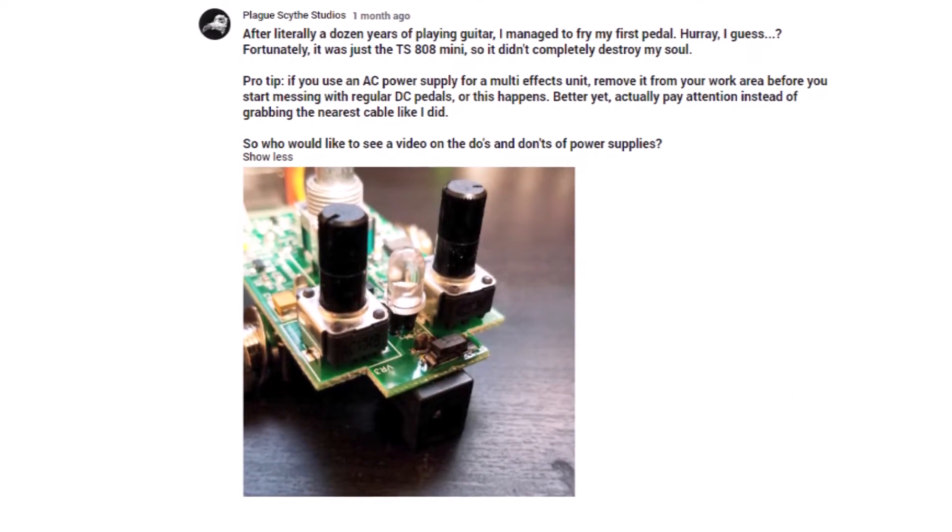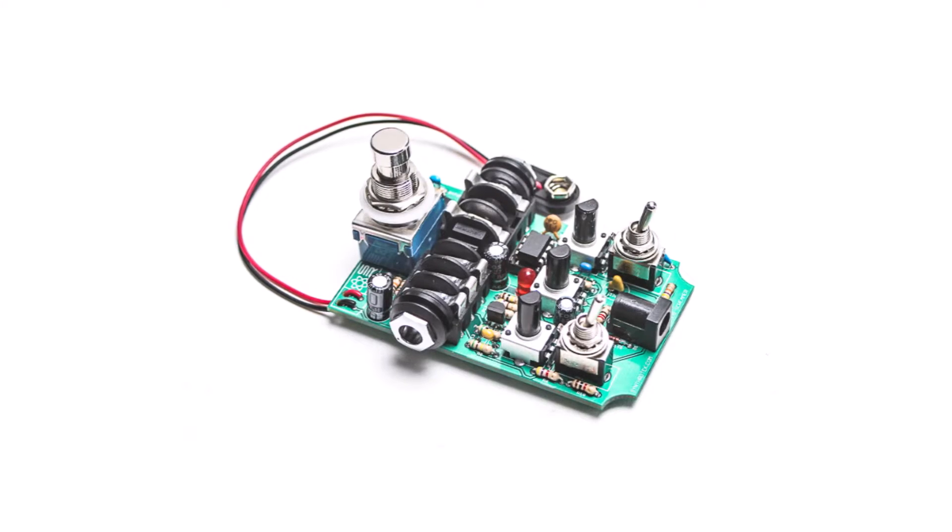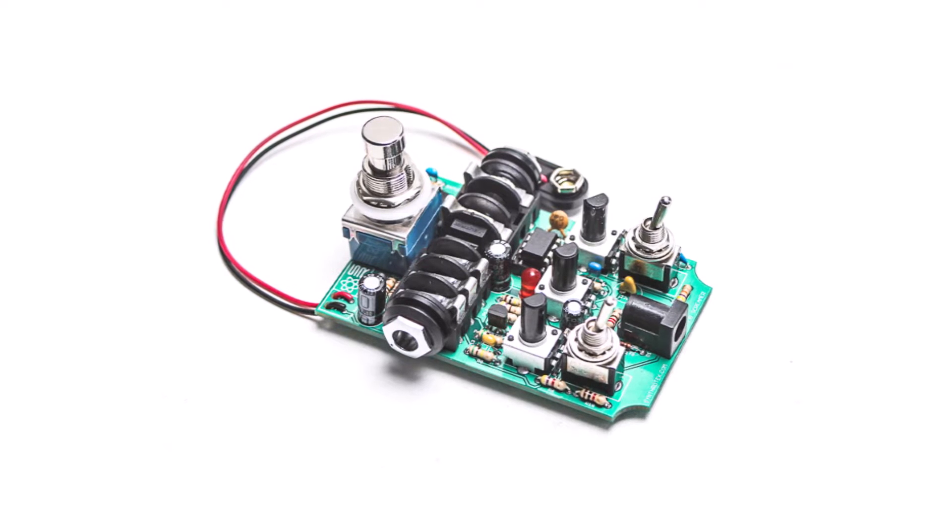That's precisely what I did about two weeks ago — you might have seen my community post where I made a little bit of an oopsie. If you've made a similar mistake yourself, you're undoubtedly familiar with the white smoke of death and god-awful smell that ensues after you plug an AC power adapter into something expecting DC power. Fortunately, this circuit actually had a safety diode — that's the first thing to be destroyed. You can replace that and the rest of the circuit will be unharmed, assuming you don't overload it with 240 volts or something. I've been playing guitar for the better half of my life and I still made that error. I knew better, and if I'd paid attention it wouldn't have happened.